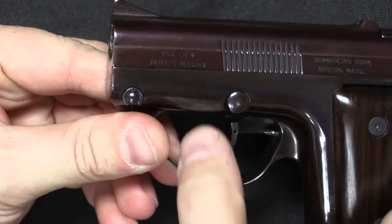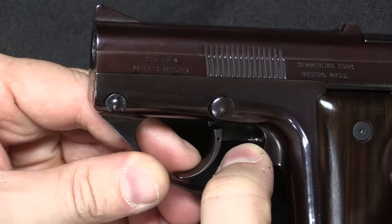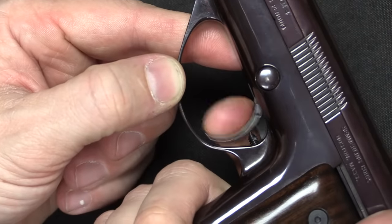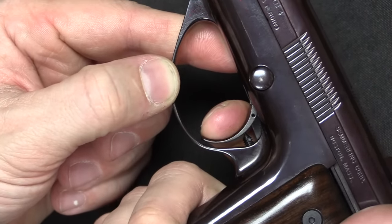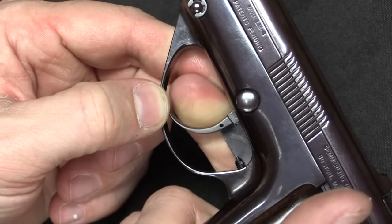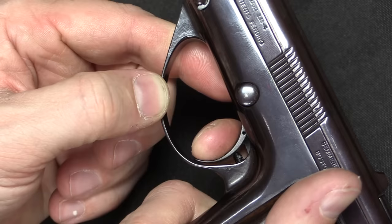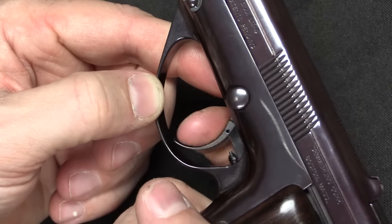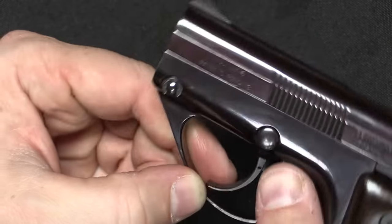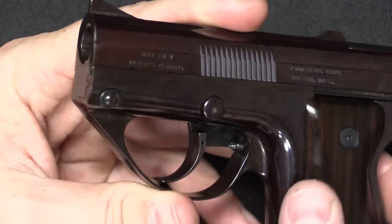This has a double action trigger, and it's actually a really nice trigger. It's this little plunger that ultimately fires the gun. When you pull the trigger you've got a very clear stop - a break in the trigger - and only after that does it fire. It's actually really easy to stage the trigger to that point, and then you have a relatively short and crisp pull, almost a single action trigger pull. You can stage it or just pull through the whole thing - they put real thought and effort into the trigger design and got a good trigger out of it.